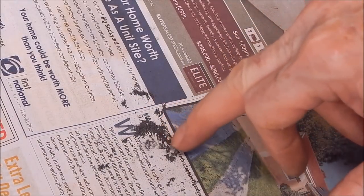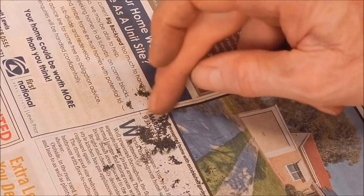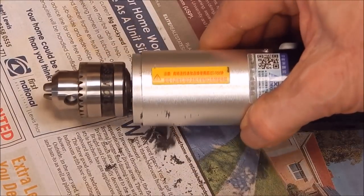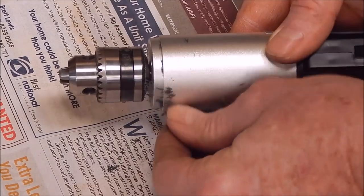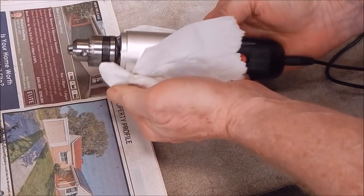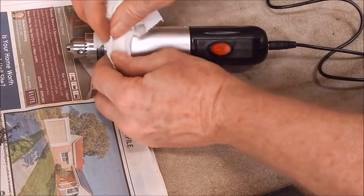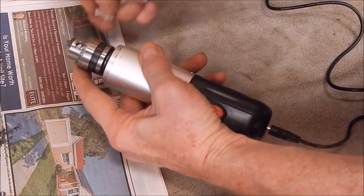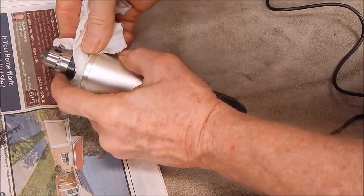Steel cuttings and grinding is going to be a problem with this little machine. Here are some lathe turnings and grindings picked up with my magnetic broom sweep — if we bring this little drill over near them, it picks them up. Now that could be a bit of a nuisance. That is always going to be a problem with a DC unit that uses permanent magnets — it will pick up grindings and cuttings. That's a big negative.